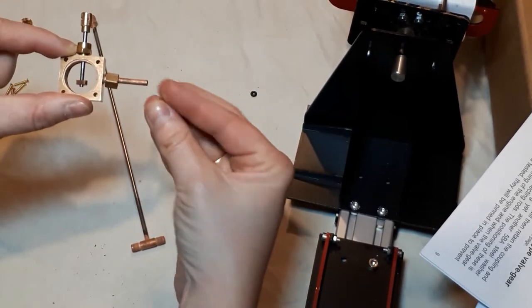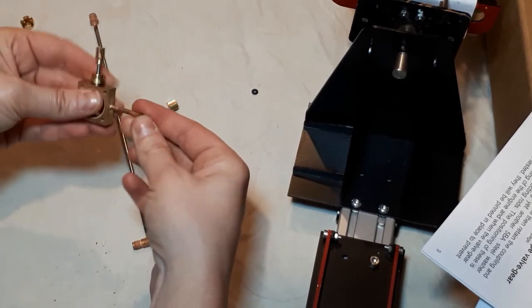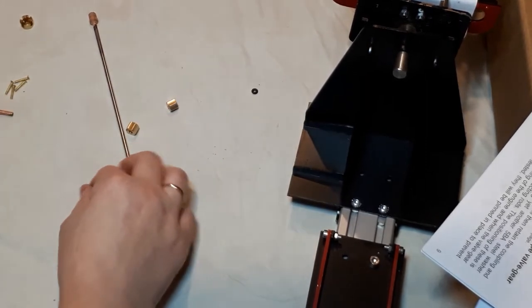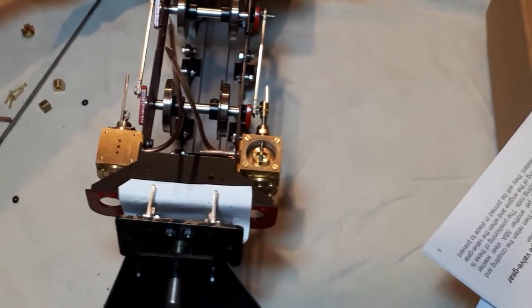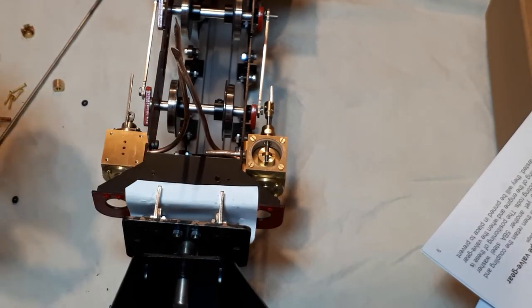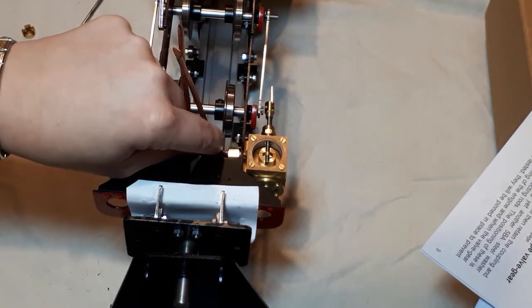with the nut and the O-ring. That O-ring is, I'll put two on there now, really blooming tight, ridiculously tight. And that is going to be a pain to do when it's in there. Also, as much as the instructions say it doesn't matter where your exhausts are for now, that also is another lie. Is that in shot there? Because where you saw me bend these earlier, if you don't bend them enough, you're not going to have enough clearance to get the nut on. So it does matter where your exhausts go because of that. And then I've got to squeeze that onto there.